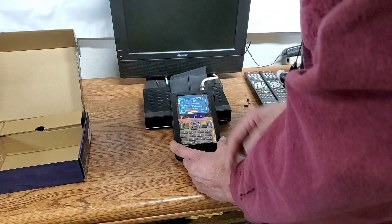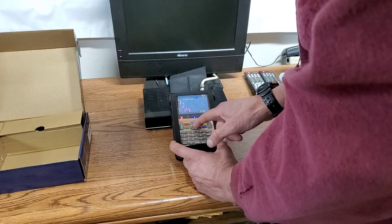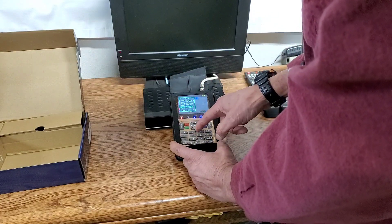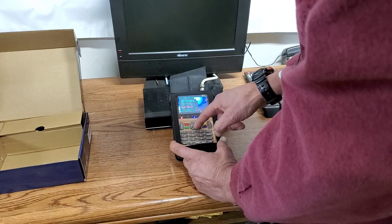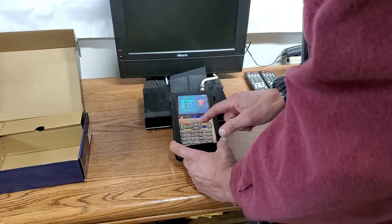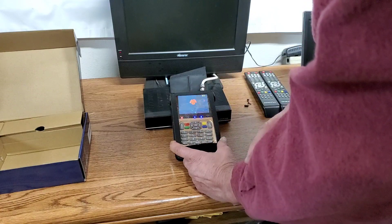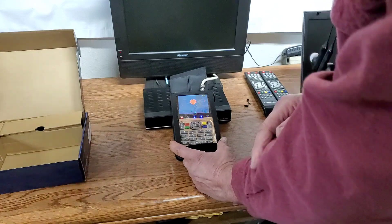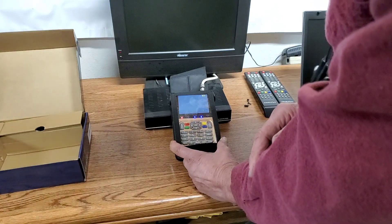When you're done aligning your satellite dish, press exit so you can see the image, and press OK so you can select the channel you want to look at. Let's go up to 3AB in English, select that, and see how that's coming in. Press exit so you can see the channel. Pretty cool for $125 — visit our website at sdadish.com. Thank you.